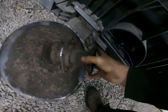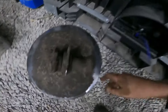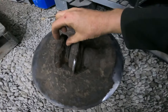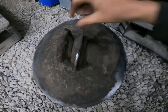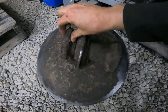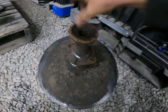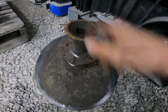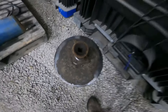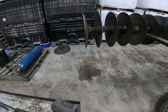Here's why you want to set things up the way you took them off. This spacer I just pulled off the end of the drive shaft — you can see here's your bearing with a spacer on each side. This one has a lot longer neck, this one a lot shorter. Set it up like that so when you go to pick it up, the piece that goes onto the big square main shaft goes first. That way you keep everything all in line. I'll show you pulling a few of these off but it's all the same thing all the way across.